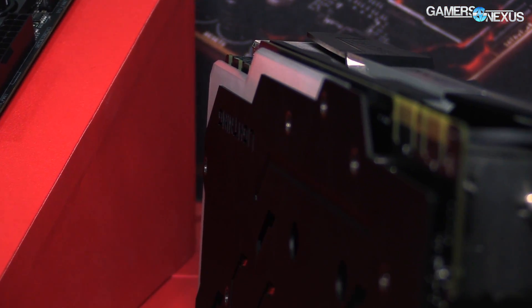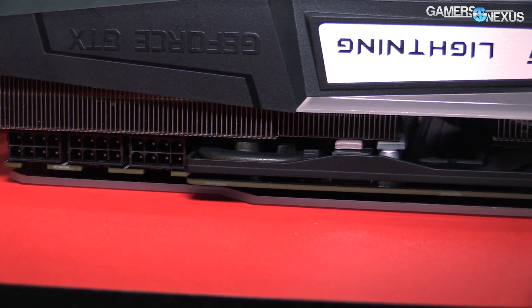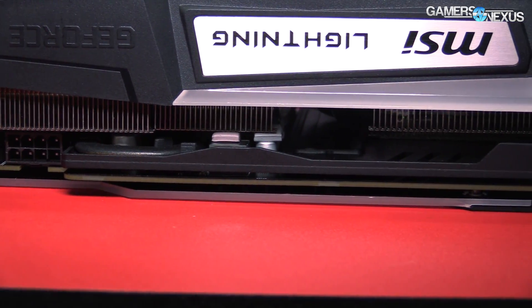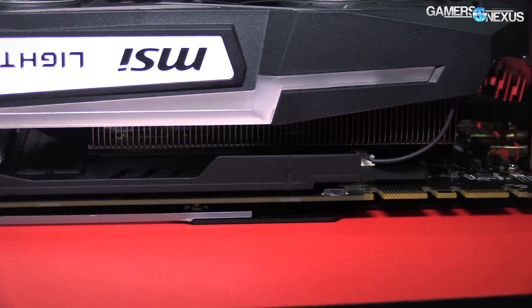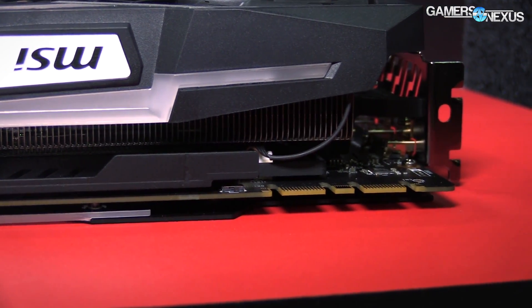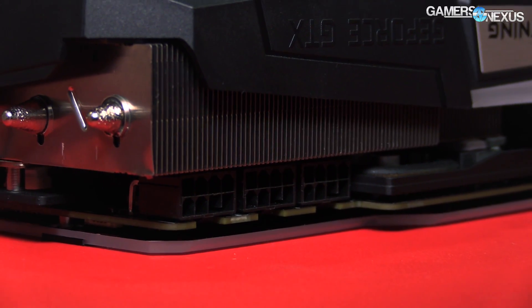For the IR components, they're using the 3570B and 3595A for the controllers. I don't know the switching frequency of the MOSFETs to the full detail just yet, but that's what we have to start with. For power, we know that it's a 350-watt TDP, and that's supplied through three 8-pin connectors on the card — so it's quite a bit of power going through the card.